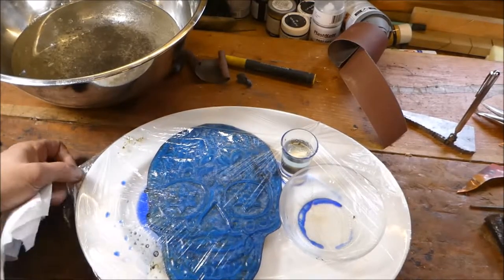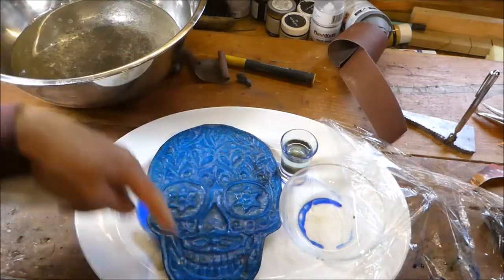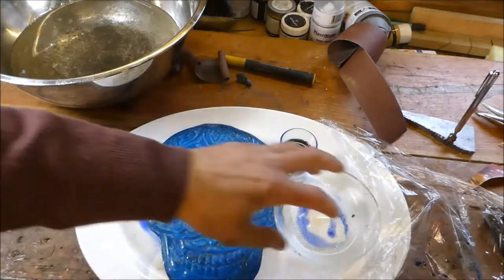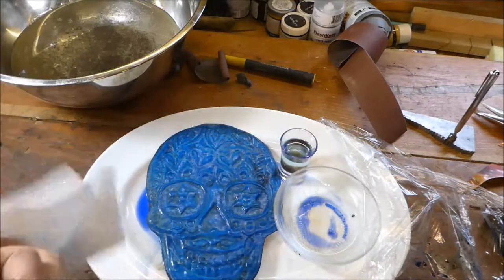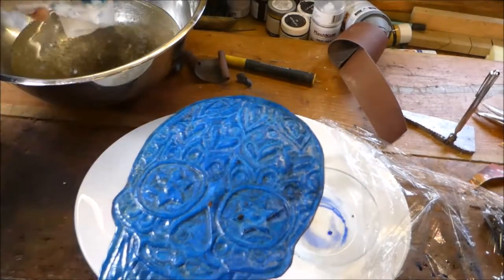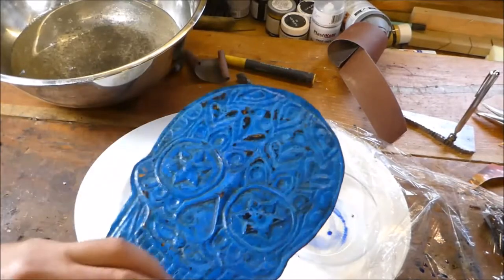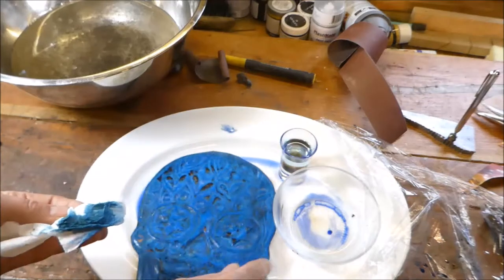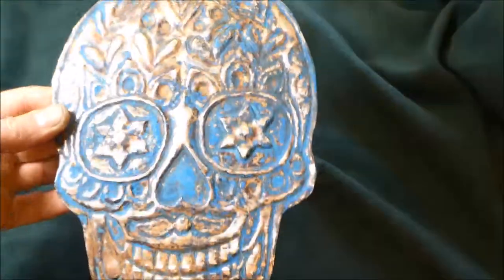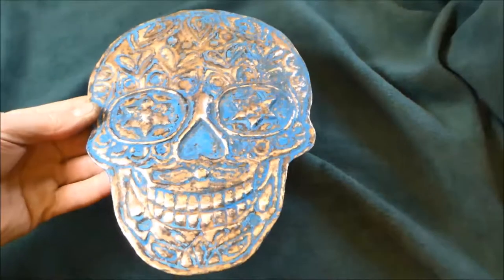It's been under here since last night. Basically that's hydrogen peroxide, vinegar and salt, and I painted it all on the head. This is ammonia in here - there's just some blue stain underneath, and the ammonia fumes react with the other chemicals which react with the copper to produce all this blue. But it's too blue, so I want to see if I can wash some of it off so that the blue is only in the grooves. I've cleaned it with wire wool, so I've taken a lot of the blue off because I didn't want too much - I wanted more in the recesses - and I really like it.